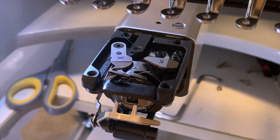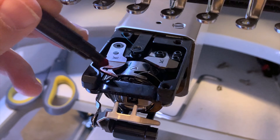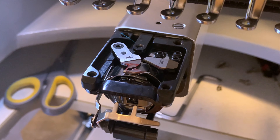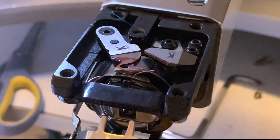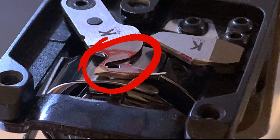In order to test the friction of the two knives, you will need to apply ink with a marker to the tip of the movable knife. Then manually move the movable knife as shown in this video. You will need to evaluate if the ink of the marker erases evenly on the movable knife. If it erases evenly, this will be a good indication that the friction is okay to perform the next test with a piece of thread. If the ink does not erase evenly, it will be required to readjust the fixed knife until the proper friction is achieved between both knives.